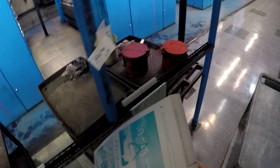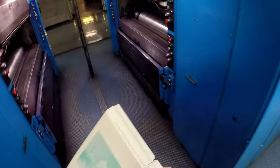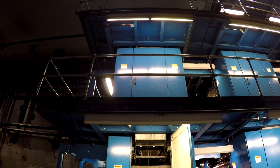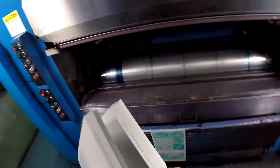Put them in the order they're going to appear on the layout. For example, this plate is page 8 of the Sun and it is black — you'll have 2 of those, then 2 yellows, 2 magentas, and 2 cyans. After you have the plates separated, it's time to spot them. Here I've got page 8 of the Sun that goes in the far center position on tower 13, on what we call the 10 side. If you're on the operator side of the press looking at it, the left side is referred to as the 10 side and the right side is referred to as the 13 side. It's called that because every cylinder on a press has a number assigned to it — 10 is assigned to the plate cylinder on the left, and 13 to the plate cylinder on the right.